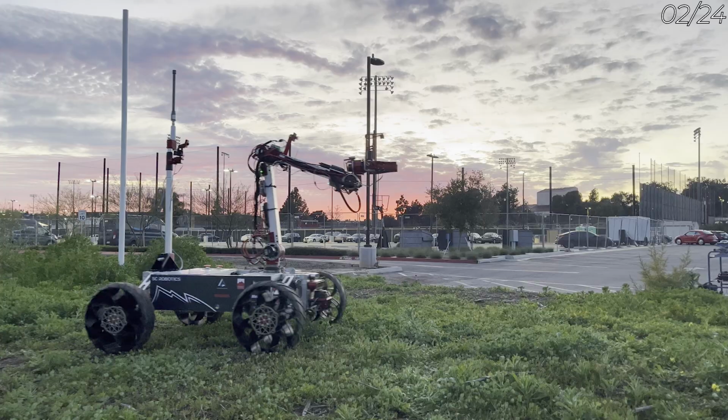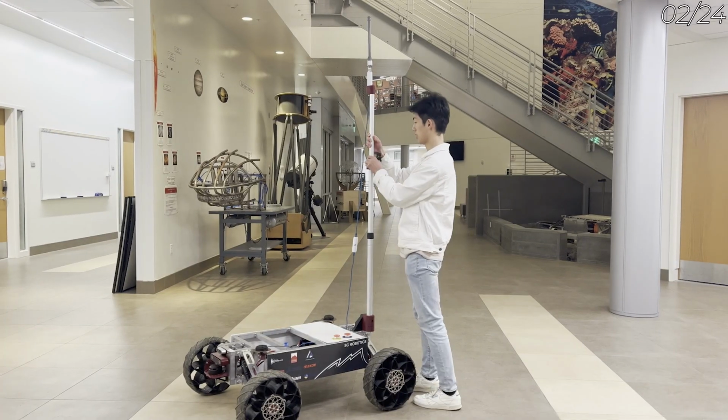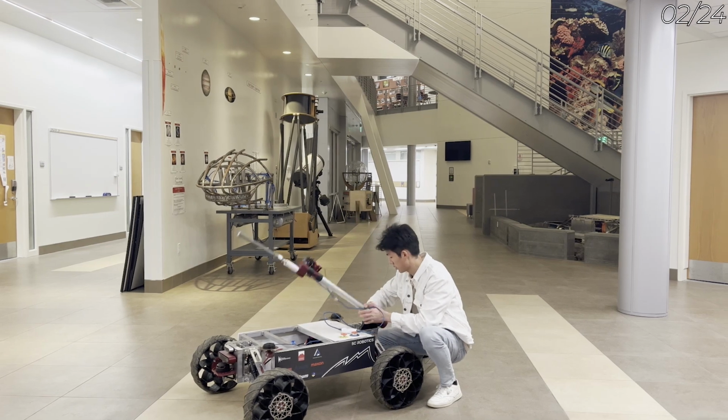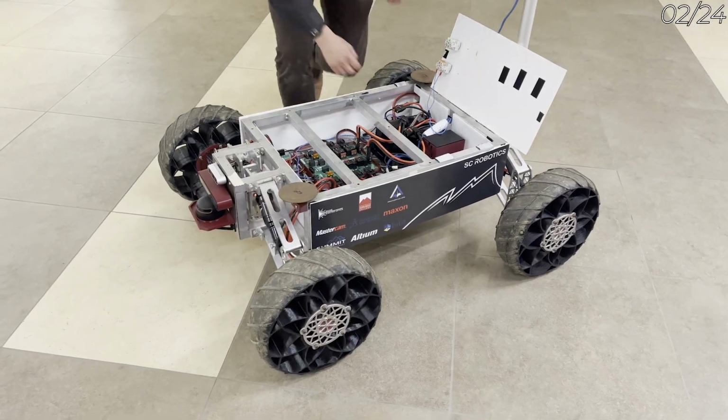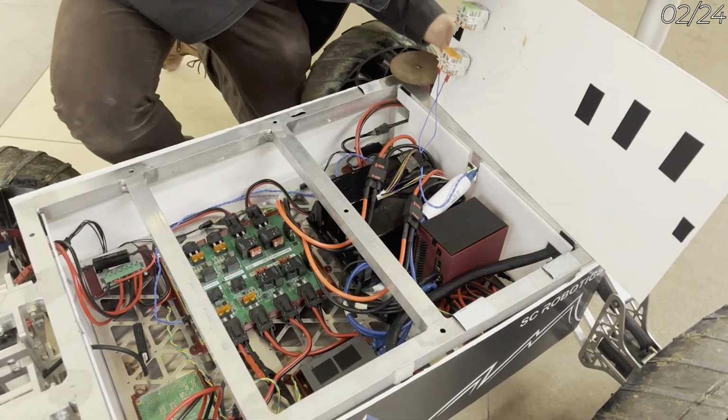Our chassis is constructed of welded aluminum tubing with removable panels to protect interior components. The chassis features a machined belly pan capable of housing electronics in numerous configurations. Ares is powered by 2 24-volt batteries connected in parallel, enabling extremely long runtimes.